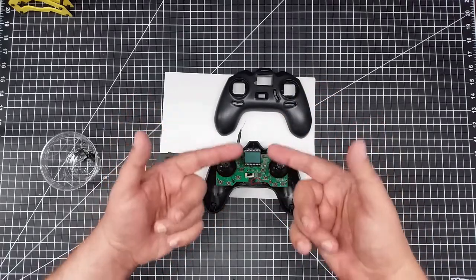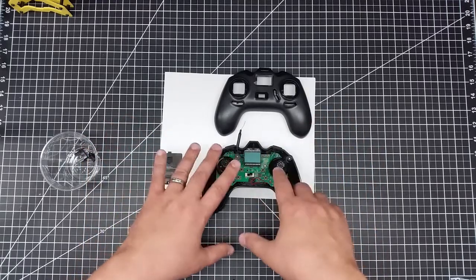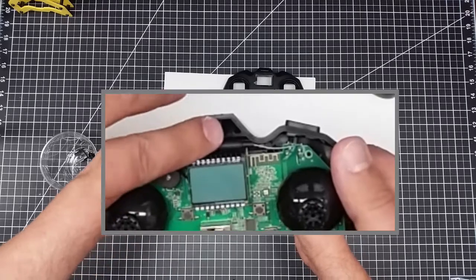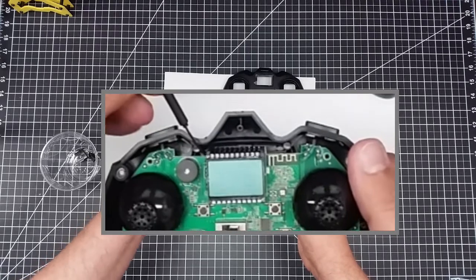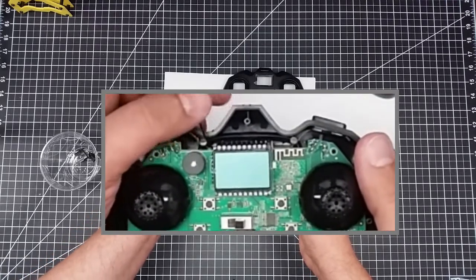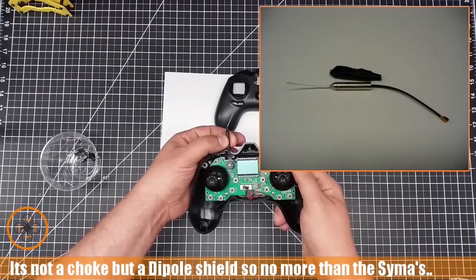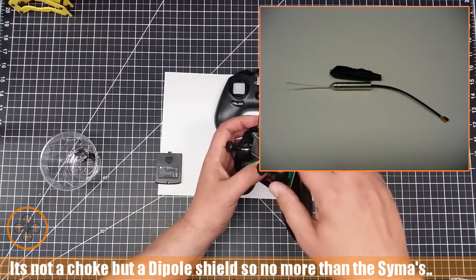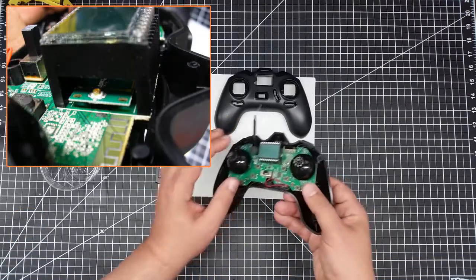I'll play around with a couple of ideas and do a video once I do that mod. But I want to show you what's in here and how it goes together. This is the antenna itself — it sits crossways in this bumped-out opening. I'll give them credit, it's got a little bit of a choke to it. It's probably more than a little bit of a dipole, but I'm not sure what's inside the shrink wrap tubing. It feels like a coil, and then it's got a micro cap connector.